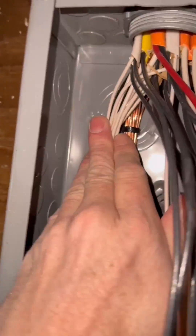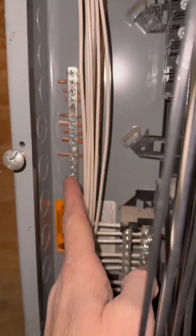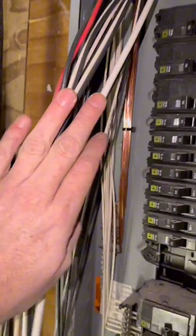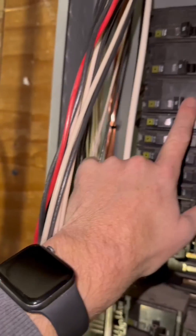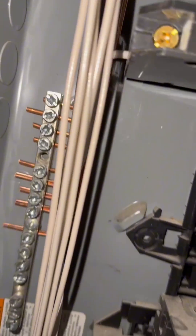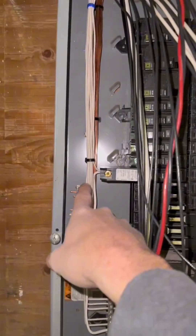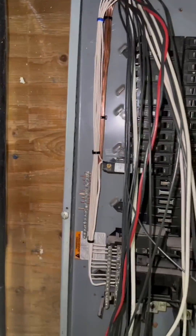I kind of look at this area as an alleyway — a trough — for the wires to go down. I did the same thing with the neutrals: I went the shortest route, whatever was easiest, right to there. Now you're going to see these hots come around here and over the top right into the breakers, so all these neutrals are going to get covered up, but the screws and knockouts will still be accessible. I map out how the breakers are going in — biggest breaker first, then work down to smallest. I took that arc fault breaker, unraveled that neutral on it, and tucked it right in there.